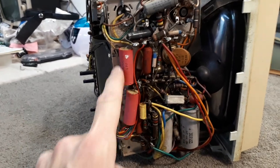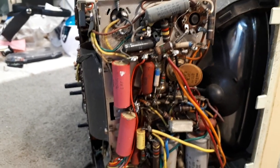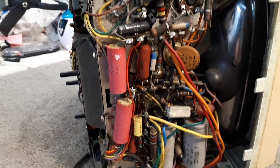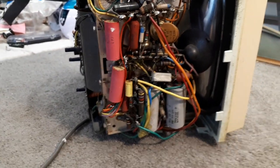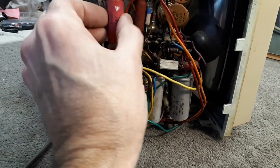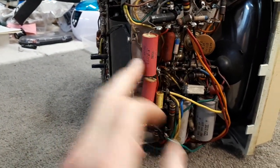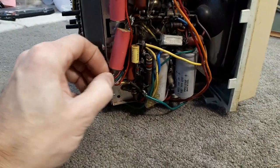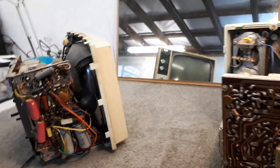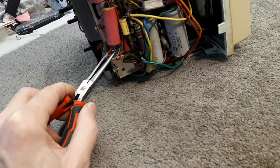This doesn't look too bad. Oh, yuck, yuck, yuck. Oh, horrible. I don't even think I want to plug this one in, actually. Probably going to have a whole pile of filter caps going up in smoke. Especially these things here. I've had these 0.0056s, I've actually had these crap out, even though they're 1,000 volts, or 0.047s. Philips K9s use them. I've actually had them fail. So, there's a repair here. Someone's just tacked it on with a bit of wire. Oh, God, you can imagine all the 1970s and 80s repair bodges that were done on these things.